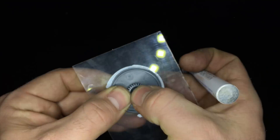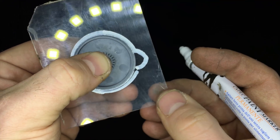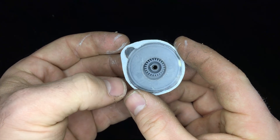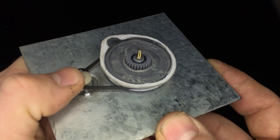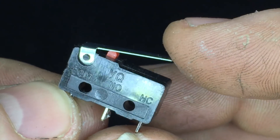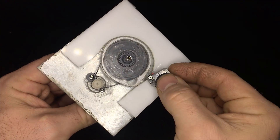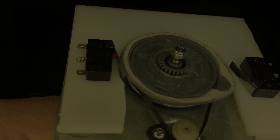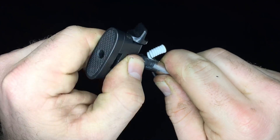Now let's take something else — a rigid plate. For example, this plexiglass plate works, but you can also use wood or PVC. Trace the shape of the pulley but make it a little bigger, including this little nipple here on the right. Cut away the part, put it on the pulley, and using some super glue, glue both parts together. Make sure they spin freely and don't get stuck. I'll also take two little switches that I took apart from the PC printer and place them on a little plastic base, keeping both switches at the same exact height as the plexiglass circle.